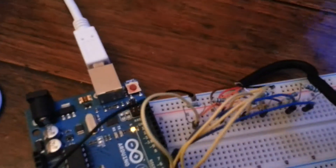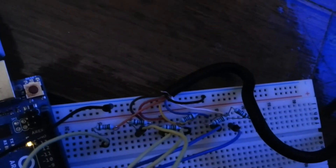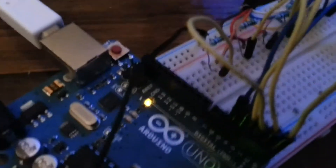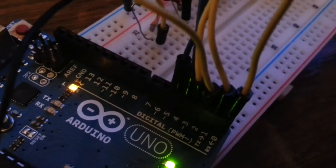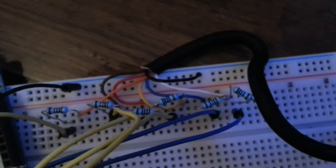This long wire leads into the Arduino, and we have set up here each of the wires which normally goes to the different buttons on the controller, connected to different ports on the Arduino. I put some resistors in line with them because I'm not convinced about the voltage or current coming in, so I just wanted to be on the safe side. We have the up, down, left, and right buttons on the left-hand side in yellow, and then the one and two buttons in blue.